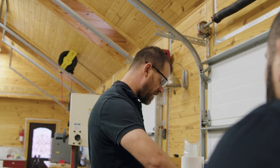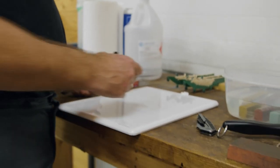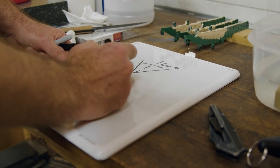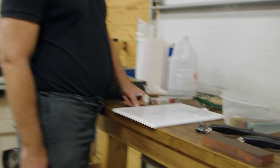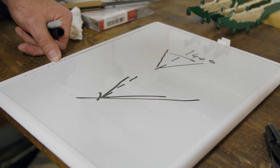Sharpening the chisel grind is one of the easiest knives to sharpen, but it confuses people the most — partly because you can't do it on a fixed knife sharpening system since most systems won't reach the angle needed for a chisel grind. It needs to be done on a stone. It's the same animal as a normal edge — all I'm doing is changing my angle. On a normal double-bevel edge, you have 40 degrees total — 20 degrees a side. On a chisel grind, you shift that center line — it's 40 degrees on one side instead of 20 on each.